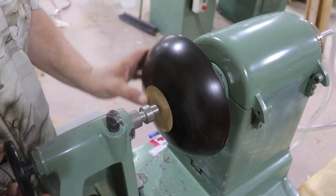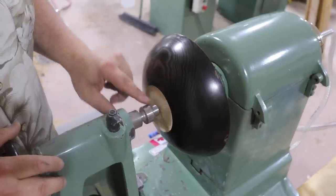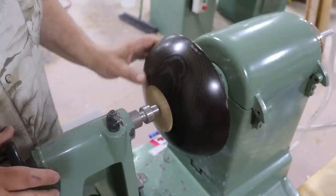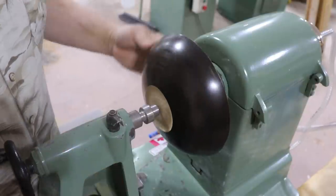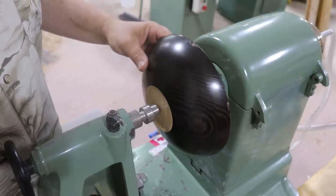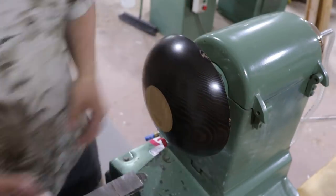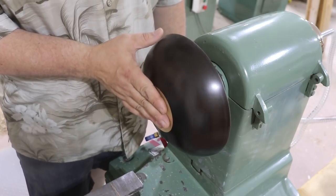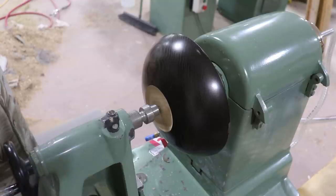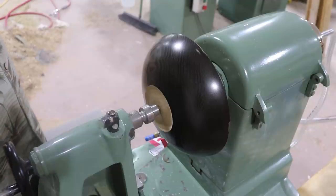It's really difficult to center the bowl back on here when it's completely finished and you have no reference for the exact center. I found as close as I could to the center and got it just touching with the tailstock point — close, but not perfect. This bowl's been turned for a couple of months so it's probably moved a little and may not be perfectly round. I'm going to turn the vacuum chuck on and see how it holds. It's a little bit out of true, but not bad.